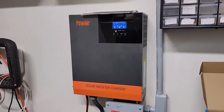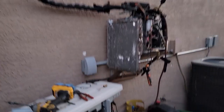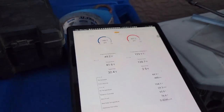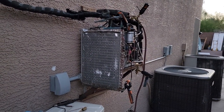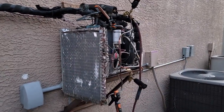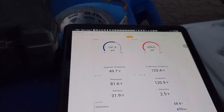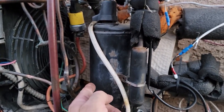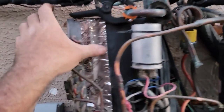I think I hear the wife about to interrupt me. It's efficient — unlike the 4,500-watt heating element that's in there. My food is here so I need to finish this up. I'm going to put one little tiny squirt of R410 in there, but other than that I gotta finish the video. Looks like it was successful — we'll see how it goes. Now I won't have that mess of a mister, and hopefully it's still efficient at heating the water. I need to have good compression ratio to get the temperature up there to keep that water hot. You can't even hold your hand on the hot gas line here — so this is probably about 160, maybe even higher. This coil with the way I have it sealed up is definitely rejecting heat.